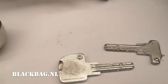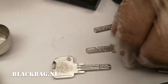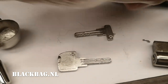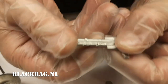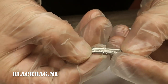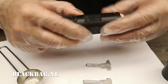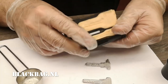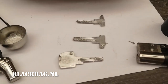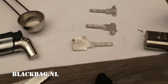So what happened — I'll try to show you. This is error one, this is the one we made two weeks ago with the shady Russian metal that apparently works. If you look at this key at the end, this is correctly done, but if we turn it over there's a ledge here. The mold was not lined up correctly — we assessed it was off about half a mil. We corrected that, and on the second try it actually works. So this metal works and now we're going to try a new casting material.